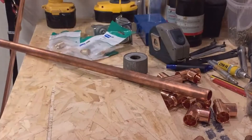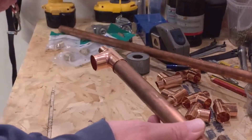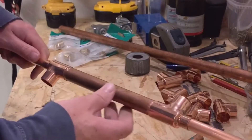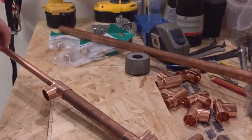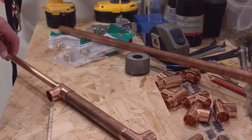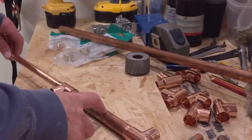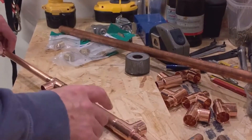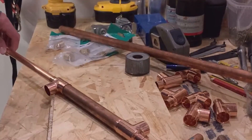Alrighty, okay so we've got a bit of 22mm. It all slots together and then we're going to slide it on our 15mm, so now you get a better idea of what it is we're trying to do. Looking at that again, it's not massively scientific—it kind of looks pretty big in terms of the coupling size relative to the one and a half meters, but let's go with that. If you guys have any thoughts on whether it should be longer or shorter, let me know. Originally I thought about making the whole 22mm piece the heat pipe and having water flowing through the 15mm, but then I thought I'd turn that on its head and have the heat pipe as the 15mm and the exchanger going through the 22mm. But yeah, let's concentrate on the exchanger now.